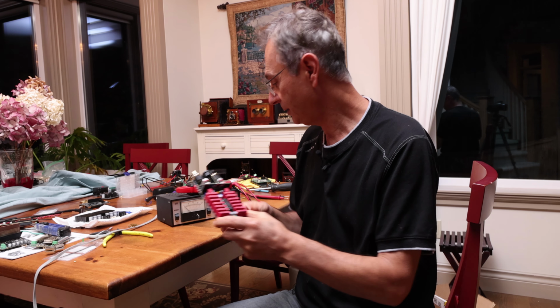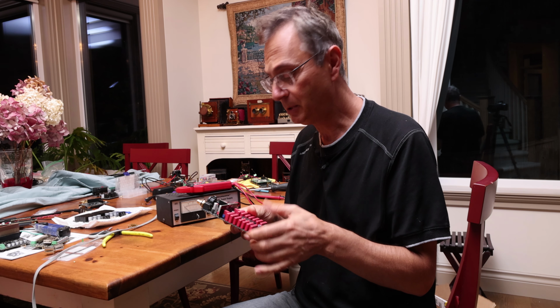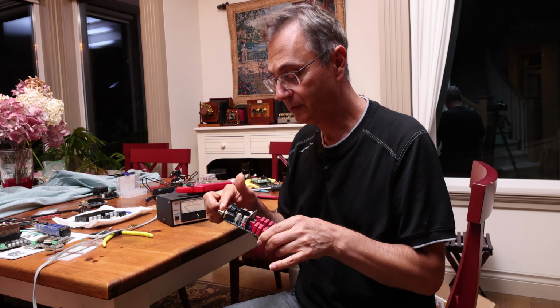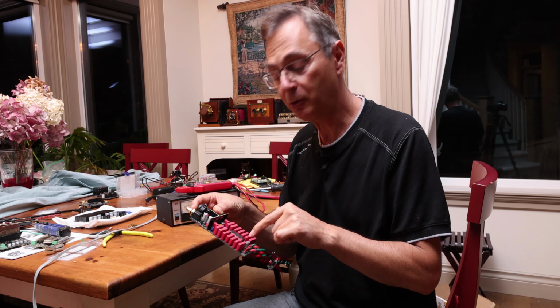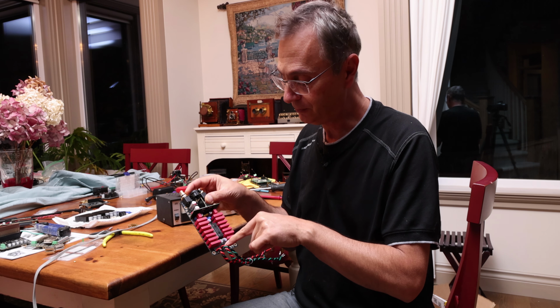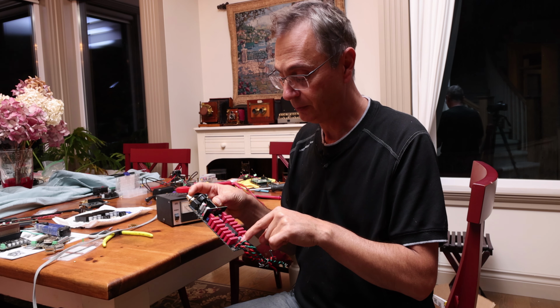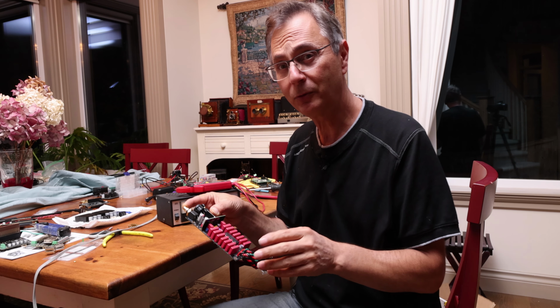You're going to have a short, and the way that happens is you won't see it right away when you plug it in. But as soon as you plug it into, for example, your amplifier from your RCA jack, this is grounded. Not grounded to the ground, but connected to what we call the ground, which is the zero between 5 and -5. So that's connected to that. It's also connected to the plus on the 15 volt, not the 0. Don't let the 2 zeros fool you.